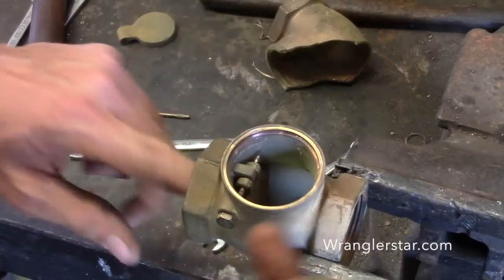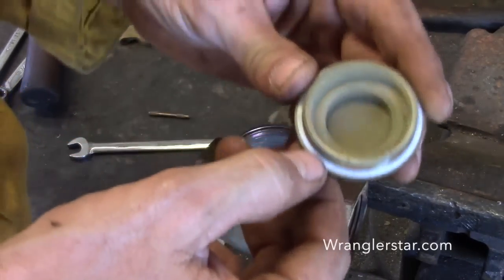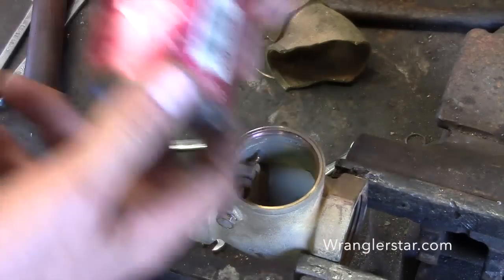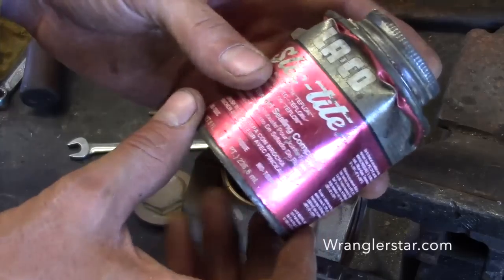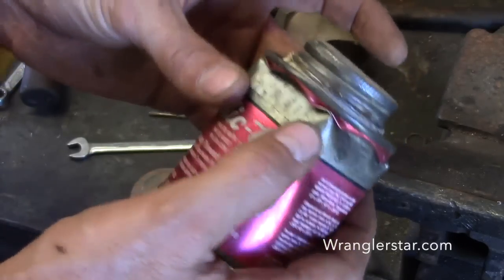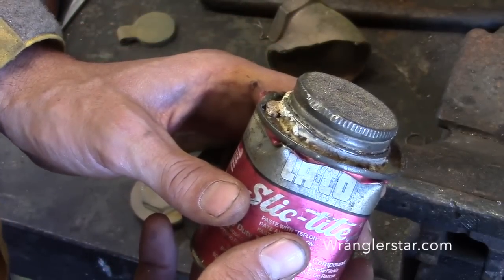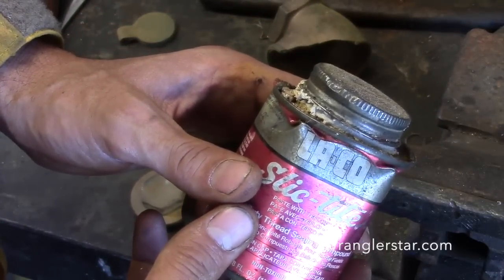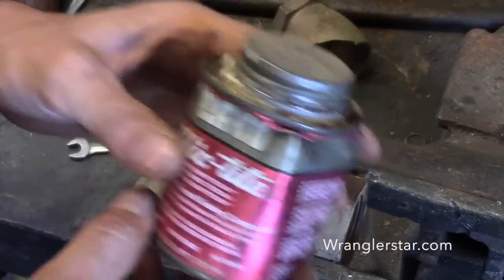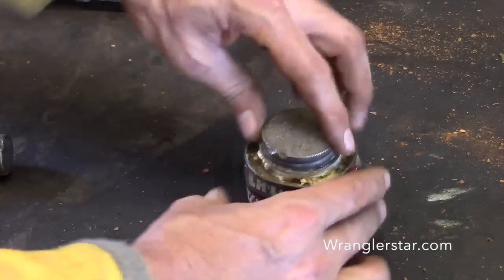This is going to be under quite a bit of pressure, so it needs to seal. I notice there's a little Teflon gasket on there — that's probably enough, but I'm going to put a little pipe dope on it as well. You can use pipe dope or Teflon tape; I think the pipe dope might be a little better, though it's messier. I'm going to show you a trade secret that you're not going to learn anywhere else — well, I don't think I invented it, but someone showed me.